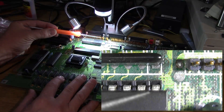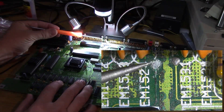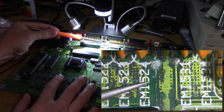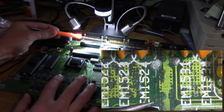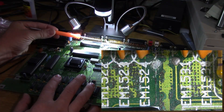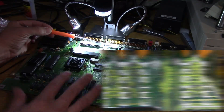I'm going to tone it out and see how bad it is. What we're going to do is clean that off with vinegar to stop any further oxidation, then scrape away some of the yuck, clean it up maybe with a little bit of an eraser, and see if we have any kind of continuity between this pad and where it's supposed to go. If not, we're going to put a bodge wire there.